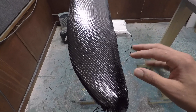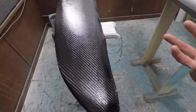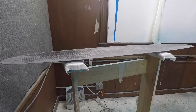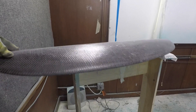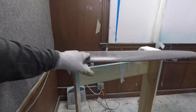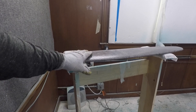Once it's at the stage where it can be flipped, I'm going to trim the leading edge and then do what I normally do with trailing edges. I now have this covered in carbon and it turned out really well. I was able to get that trailing edge really nice and thin and it's holding up well. That slightly new technique worked out pretty well. The leading edge is great and the stiffness is pretty good — it's not fully cured yet on the top side, but it'll get a little stiffer as time goes on.